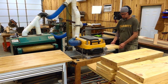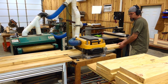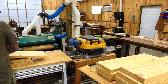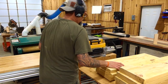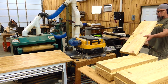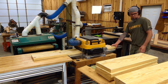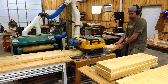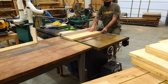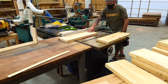Next, I'm going to run my parts through the planer just to knock off any cupping or crowning. These two-bys are cut just a bit heavy to begin with — instead of just an inch and a half, they may have an extra sixteenth, which is perfect. Keep in mind that the total thickness of all six boards stacked will have to be replicated by the width. We want this block as close to square as possible. Then I'm going to rip the sides off these boards to match the thickness of all six stacked — right at nine inches — and this also gets rid of those rounded-over edges.